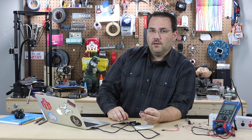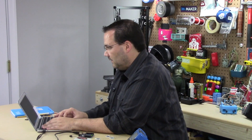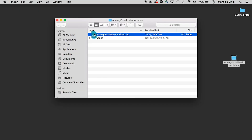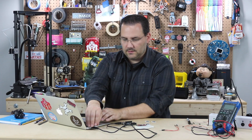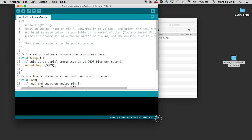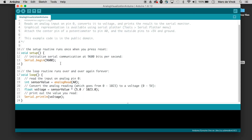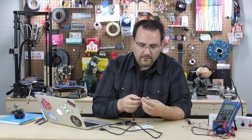If you go to the Myoware website, you can download the code. I have some sample code that I've already downloaded and I'm going to open it up — Arduino is loading up. My Arduino is plugged in, so before we wire it up, I'm going to unplug it. Looking at the code, it's communicating at 9600 baud and we're reading analog zero. It's really just an analog read.